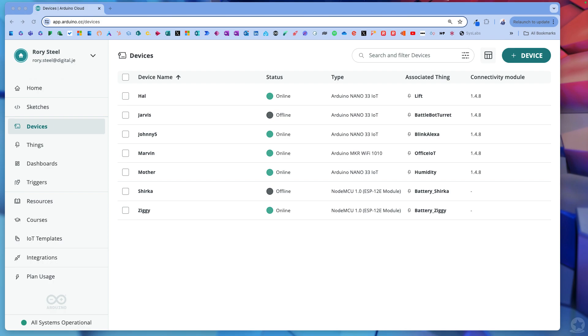We've got other small, cheap microcontrollers like the Raspberry Pi Pico here - this is not the W version. The W has just got a wireless chip. This one's about six or seven quid; this one's about 22 to 26 depending on where you get it from. It's part of the Arduino Uno range. Once you learn this, you can start using ESP8266s or ESP32s, which are very cheap, low power devices. You can work your way up with Python all the way up to the Raspberry Pis.